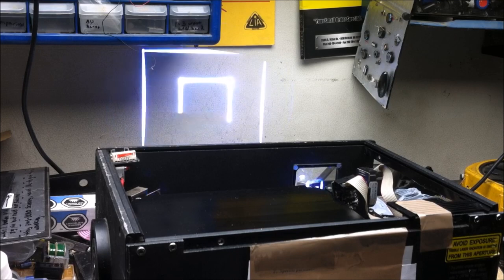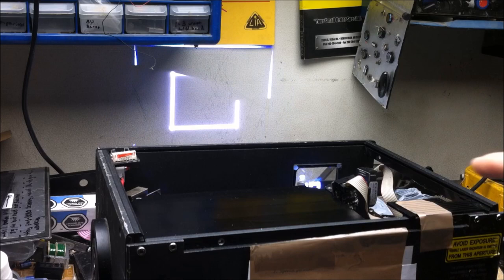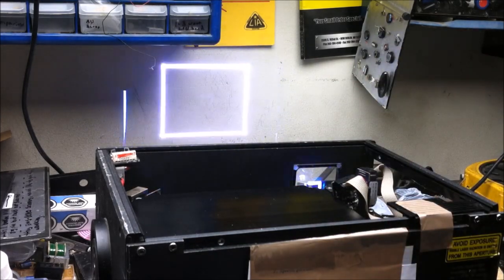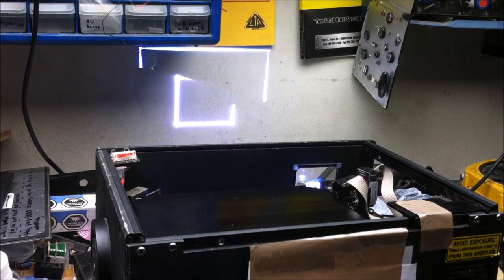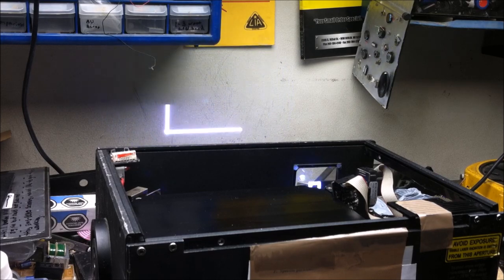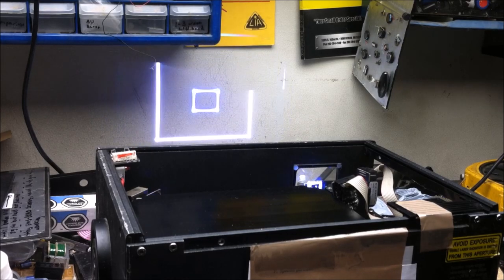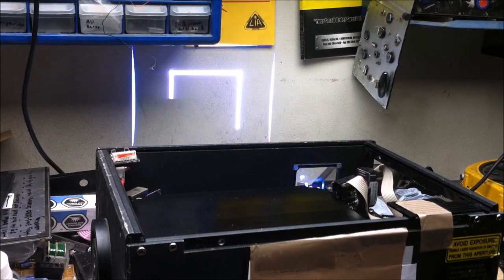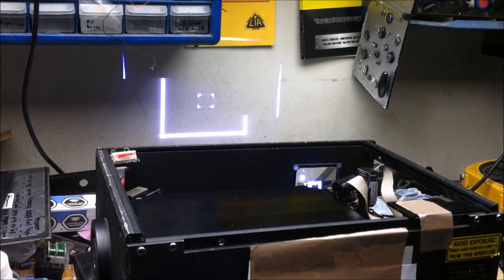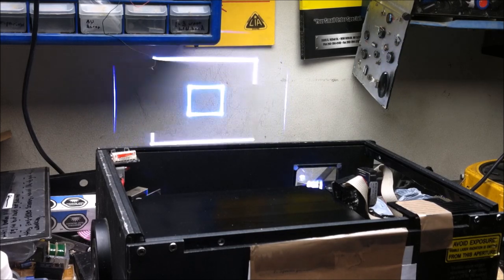The one thing I don't like about these iMagic Galvos in particular is that the optical system uses a square shape as a pickup. Once again, the problem with that is that it finds a home position in more than one location. We've seen that earlier in the video. I do not like that failure mode. Just the fact it can find more than one position to start in as a home position, very bad. So, not a fan of its design. I don't like it. I hope they moved away from using that center pin as an over travel stop in the galvanometer. It's a bad design.